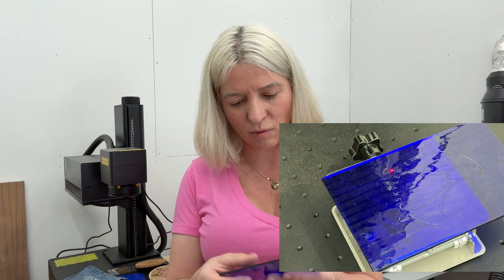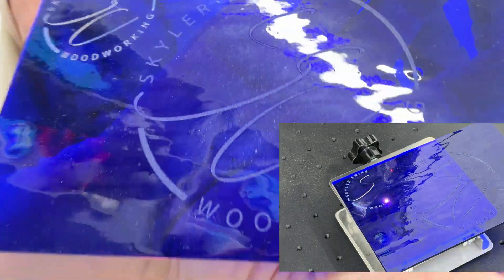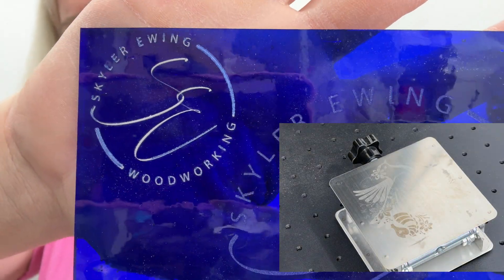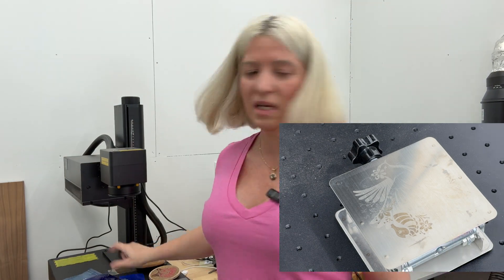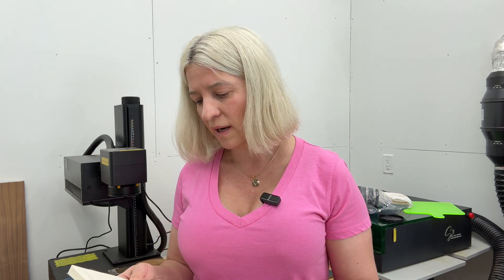For glass I used stained glass since I didn't have clear glass on hand. I did two engravings — one faded and one brighter — by changing the lines per inch. For both: speed 1000, frequency 40, Q-pulse 1. Lines per inch 800 gave the more faded result; 1200 gave the brighter result.